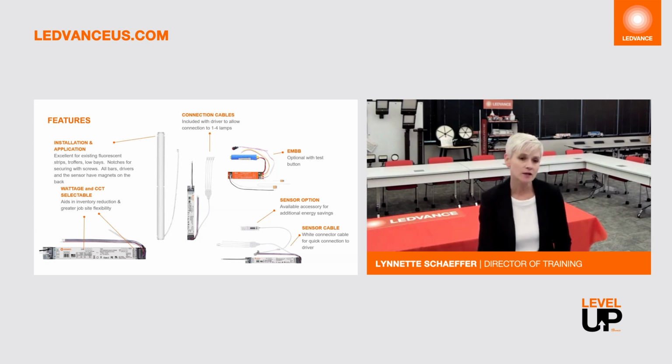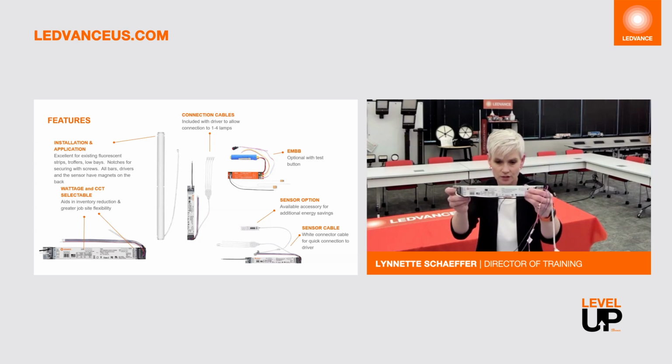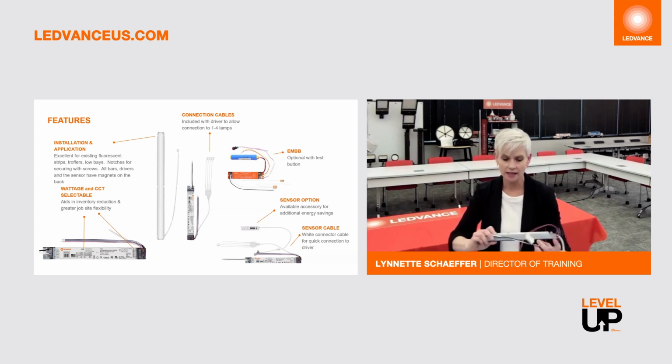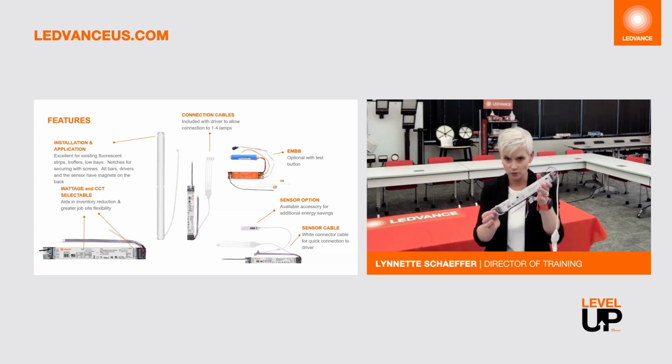The other thing that's kind of nice about this system is that it also features wattage and CCT selectability. You can see that right here on the driver. There are little dip switches right here where you can choose what CCT you want. And then here is where you would choose whether you want 1 lamp, 2 lamp, or 3 lamp, and that's also associated with 20, 30, or 40 watts. So this is a really cool feature as well.